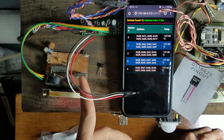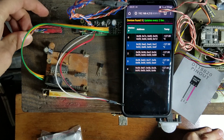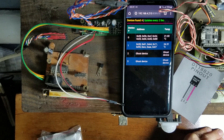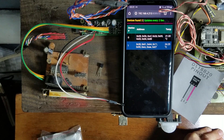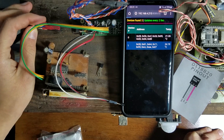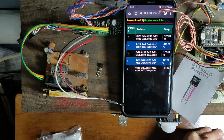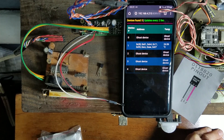But that is not all. If I disconnect all distant sensors, it starts to work without errors. Now I only have two sensors connected – one that measures temperature inside, and this fake sensor. So if you have a short bus, you may not even notice a fake sensor. But if I connect other sensors, I have only errors, no temperature readings at all.